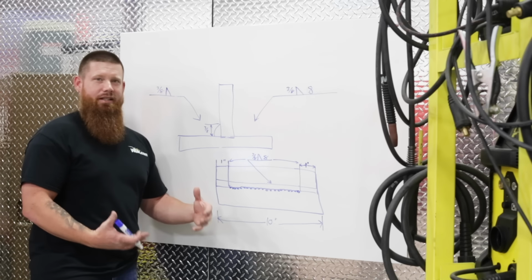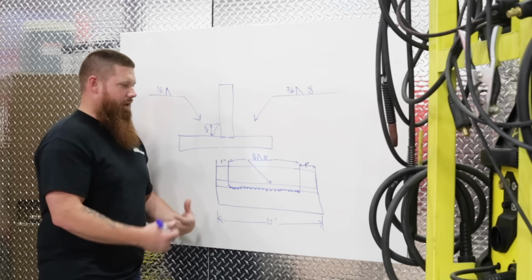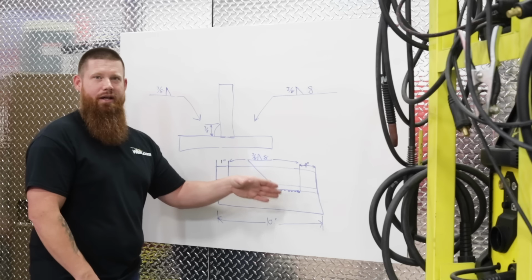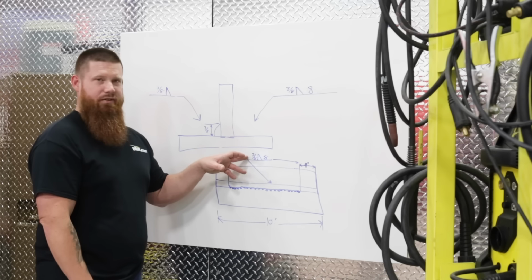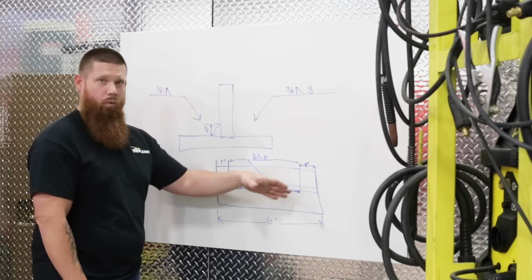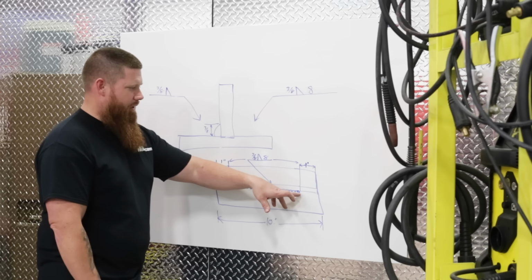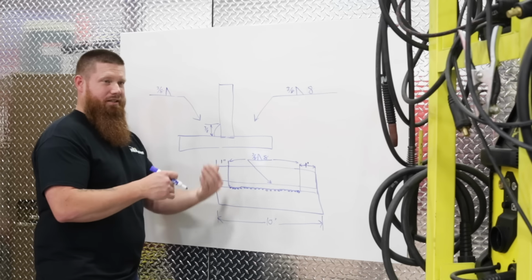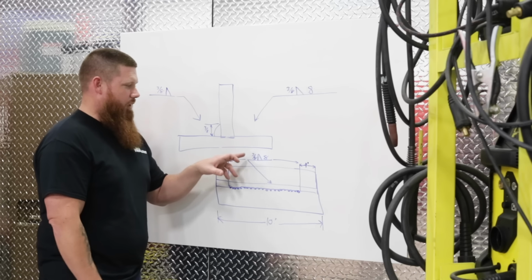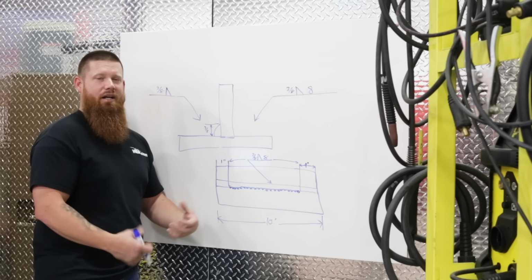Make sure you fill into the entire cross section of that weld, because that is where the CWI is going to come and inspect your work. That's where he's going to measure too. He's going to measure at your crater. Your crater needs to be 3/8 of an inch, because if it's anything less, he has to go by the weakest link in the chain. So if you have, let's say, a 3/16 weld, because that crater is not completely filled in, he's going to mark this whole thing as a 3/16 weld, and it's going to be undersized. So you need to make sure that you weld to the complete size that it's supposed to be.